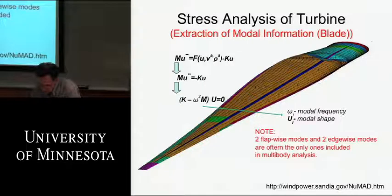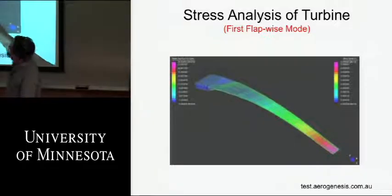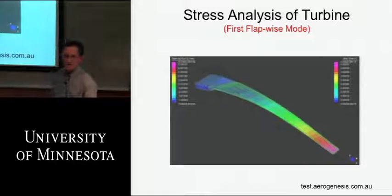So one of these examples is here. This is an analysis of a structure like that, which is really a beam, thin wall, very thin, and natural frequencies of that beam computed. This is the pattern that represents the stresses that you can compute using this subdivision of the entire beam into pieces and then putting it together to form one big matrix equation.